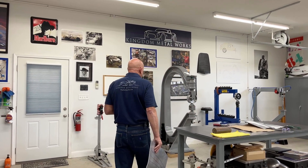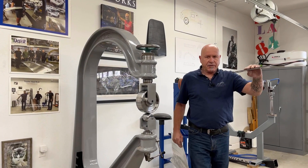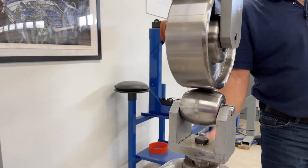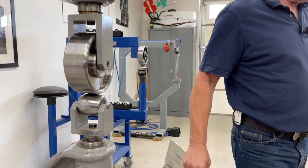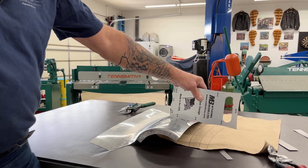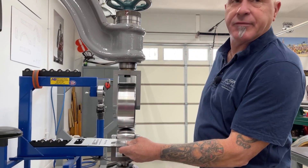I've set up the wheel basically with a flat top wheel. I like a flat top wheel — it's not completely flat, it's shaped with a little flat right in the centre, as you can see there's a witness mark to it. I'm looking at the profile gauge to see what kind of shape is in the panel — it's just round about a number four radius roughly, give or take.